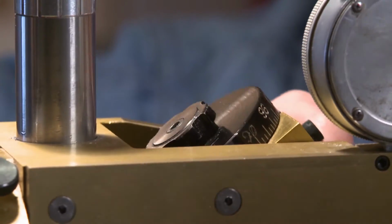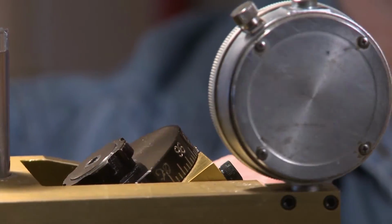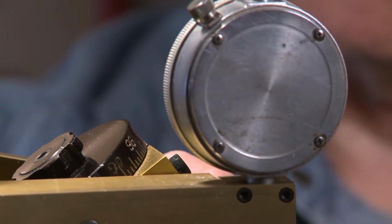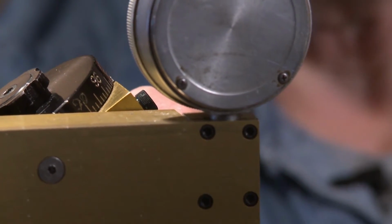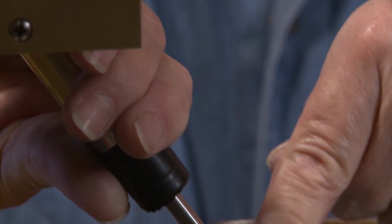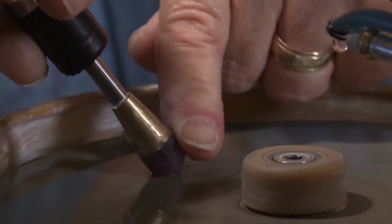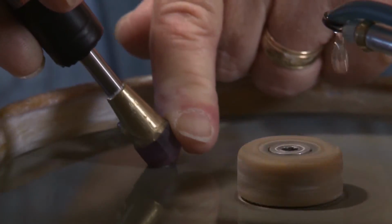It also tends to cut a little faster if I move the stone back and forth across the lap, because the water actually erases or moves some of the stuff you're grinding off the lap. And so if I move back and forth like this, it ends up touching diamond all the time instead of bouncing around on top of the stuff I'm already cutting off.